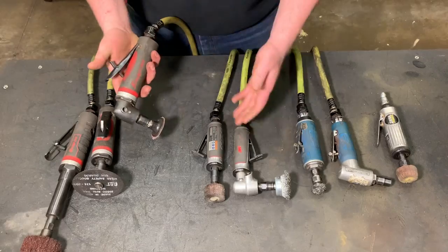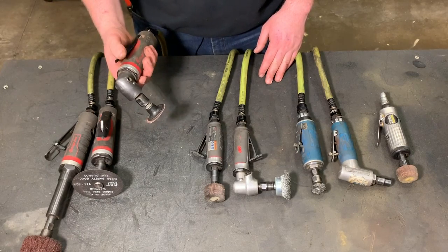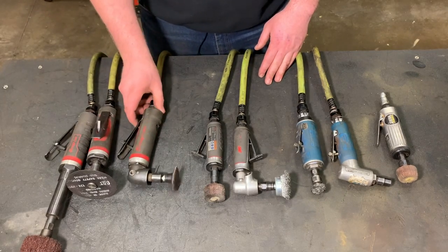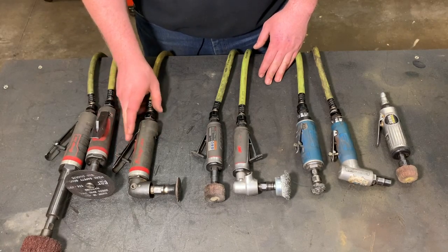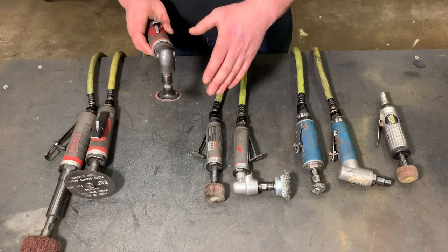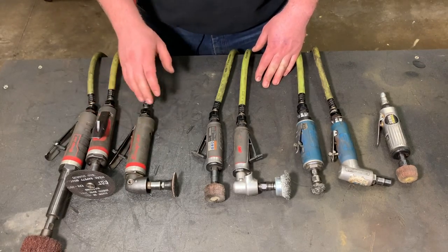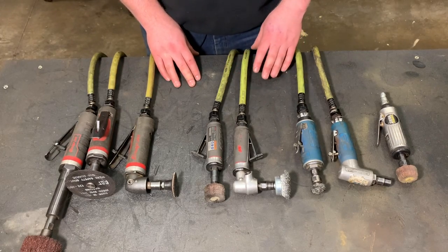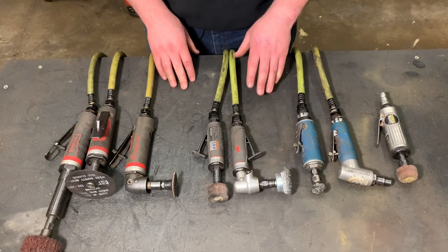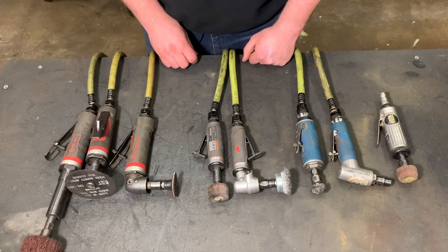In comparison from the IR to the snap-on, the top side control is just a little awkward to use, so I tend to just run it full bore. Usually it's some big grinds, or a lot of times I'll run a bigger wire brush on it and put the handle on it in order to control that. As far as big powerful things, these are beasts. I do know that Mako's one-third or half horsepower series are really nice and actually pretty comparable to these IR die grinders, and I have used those and enjoyed them. But I have eight die grinders here, and this suits me pretty well at this point.